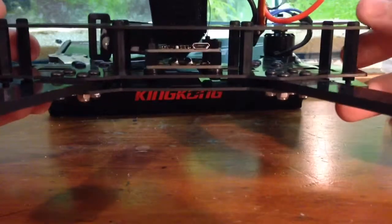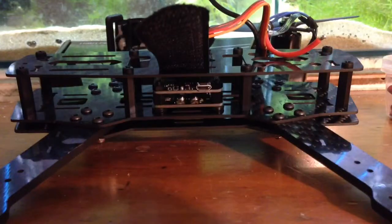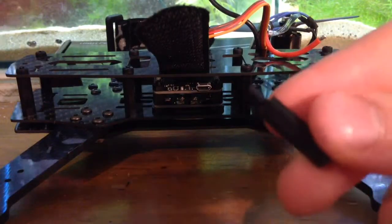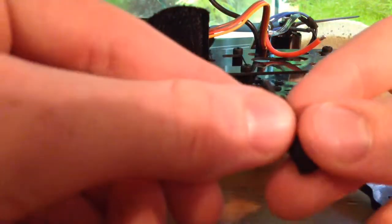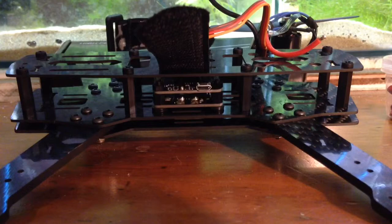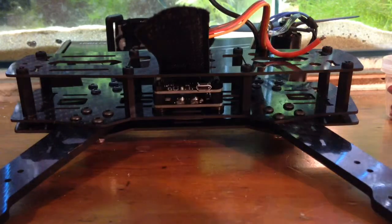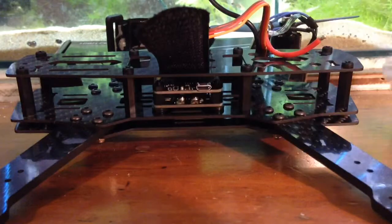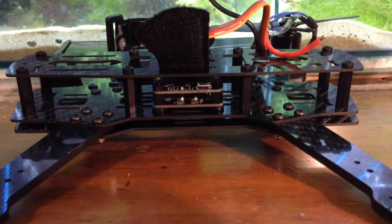Right away, something I'm doing differently is I'm using 25mm nylon standoffs. They've got this little male-female knob here that's going to snap very easily, so I'm going to take it apart and replace it with these ones. And then in probably a few weeks when my standoffs come, I'm going to replace them with aluminium 25mm standoffs.